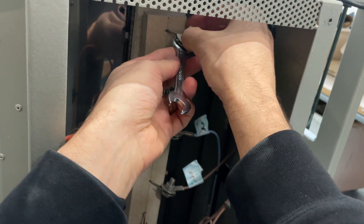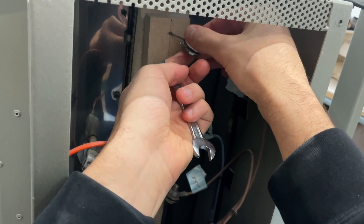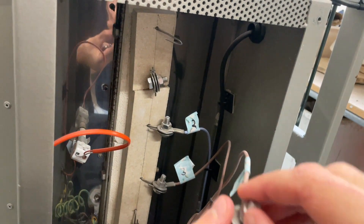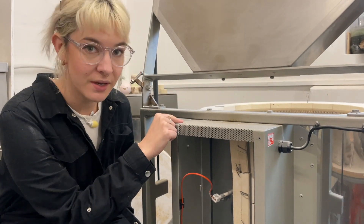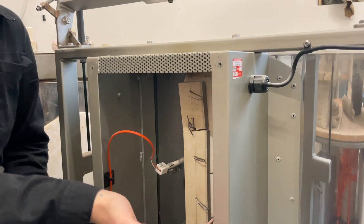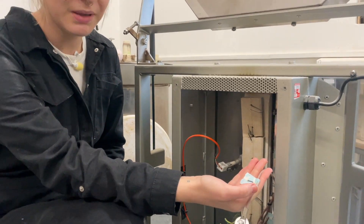Every kiln is different — not every kiln will have bolts like this, some have little clip thingies, they're all slightly different. But they're all kind of the same thing: the elements are attached to a wire where the power comes from. However your kiln is set up, you should follow that. Everything has been unpinned on the inside and all of these have been undone from their wires, and we know which wire is which because they are all labeled with a piece of tape.